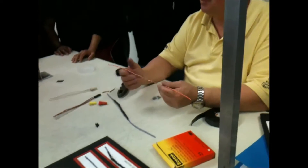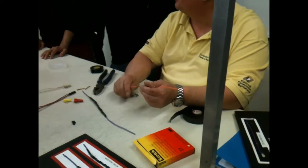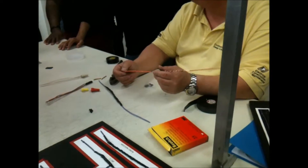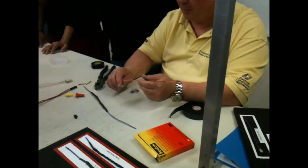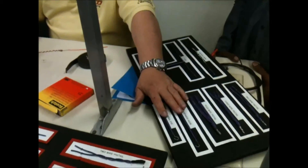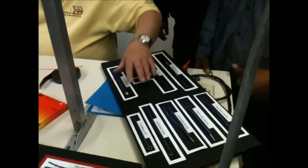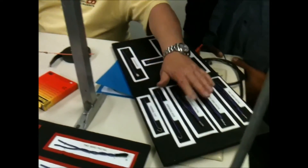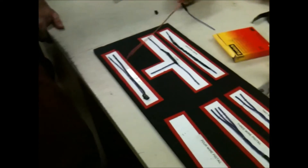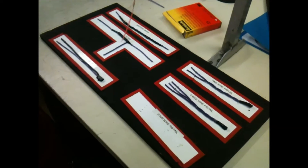So it's tape, solder, wire nut — study that sheet so you know all the answers. Any questions? There's no wire nut on the fixture splice? Yes, definitely put a wire nut on the fixture splice. The only ones you're not going to wire nut are the terminal eye, the shepherd hook, and the T-tap — the Western Union and T-tap get tape. The two, three, four wire pigtail and fixture splice get wire nuts.